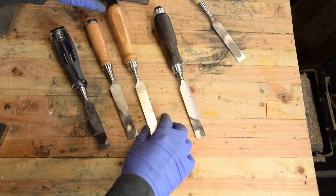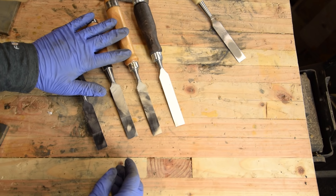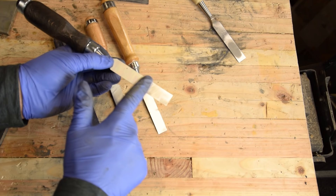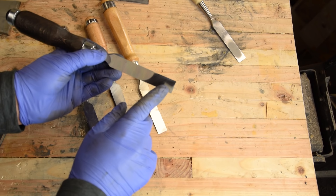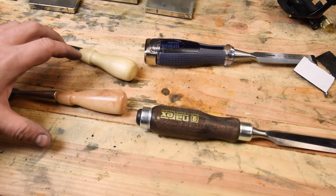I've still got some work to do on some of these. We weren't expecting a whole lot out of the Harbor Freight and the Aldi compared to the competition, but the Aldi has actually been reasonably flat — actually comparable to the Narex, which is quite a bit more expensive. The Aldi is $5 for a pack of four while the Narex are significantly more expensive. The big disappointment with the Narex is that the steel is very hard, but the back of the chisel out of the box is nowhere near flat — there's an incredible hollow right at the edge of the back of the bevel, which is a critical component to be flat. That was actually quite disappointing.